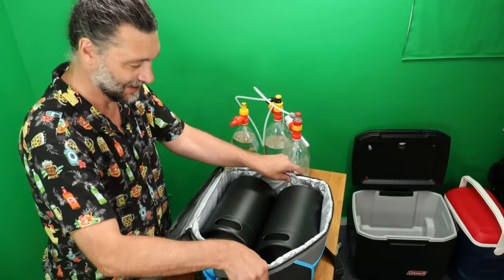If I was serving maybe seltzers, something non-carbonated. And we can do the same thing with the other taps. See, that would be too fast for beer. So this one had the 3 millimeter. Let's compare the difference. Let's see, there you go. A lot more casual flow.